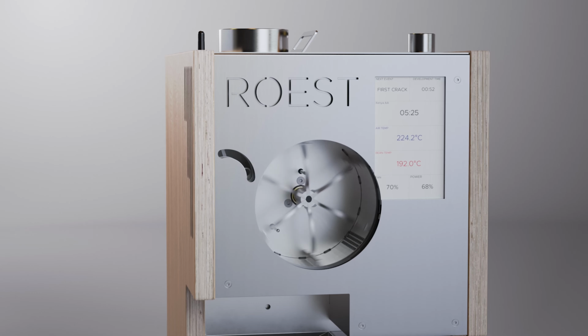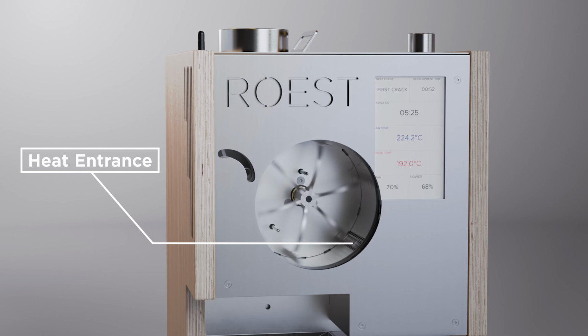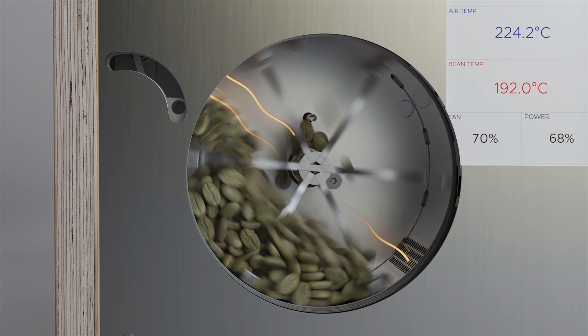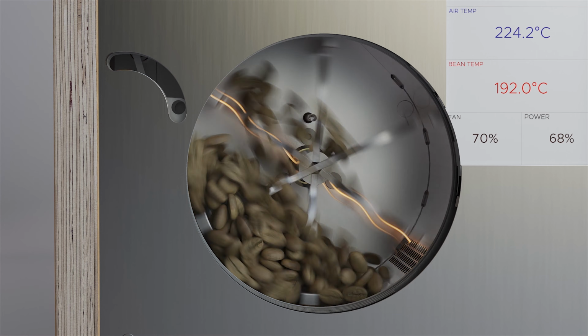So, now that we know what all the parts of the machine are, I just want to briefly explain how it works. The ROEST is a hot air roaster. That means all of the heat coming into the roaster comes from hot air that we blow in. We don't heat the drum itself directly, and so the beans heat up by convection from the hot air. Hardly any heat comes to them by conduction from the drum itself because it just doesn't get that hot.